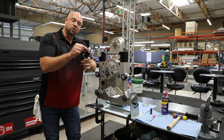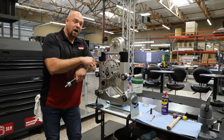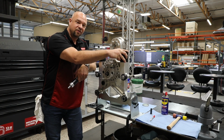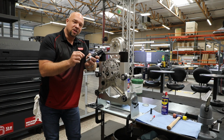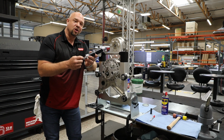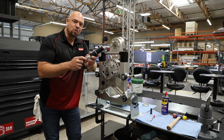The motor comes with the O-ring ready to install and the wires already attached. There are O-rings at the bottom of the assembly to protect your motors from dust and debris in the field. There's also a keyway that would be worth ordering because we're going to take the parts off the old motor, the worm gear, the thrust washers, and the other parts and pieces, and install them on our new motor. So go ahead and order a new keyway because sometimes those get boogered up when we take them apart.